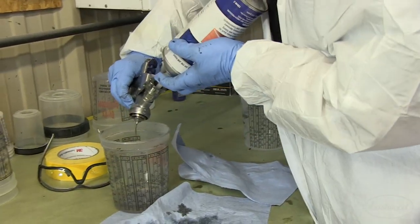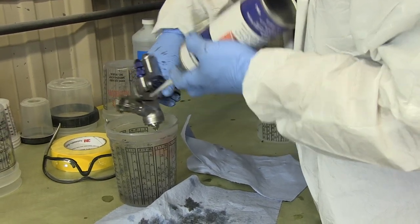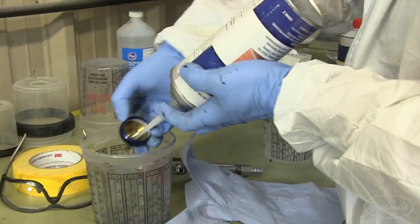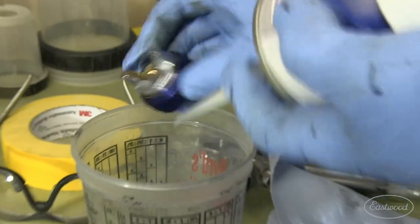I love aerosol-injected cleaner. It allows you to really clean out the air cap and the air horns, which are critical to having 100% distribution of the paint. And it saves you from investing in a lot of cleanup thinner, which you'll need to properly dispose of afterwards.